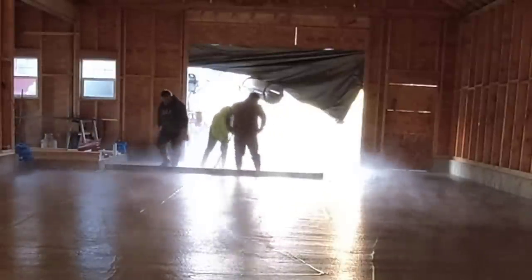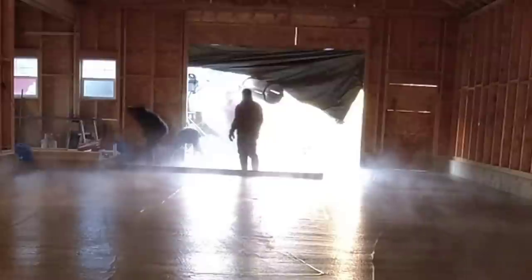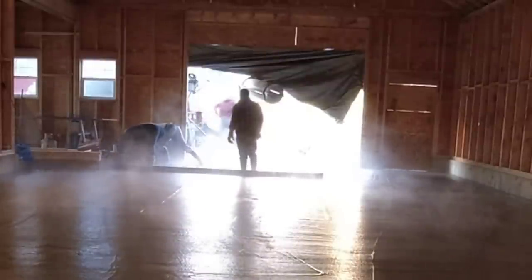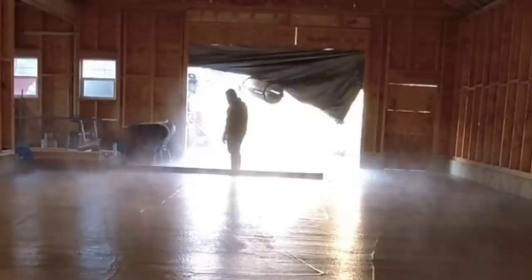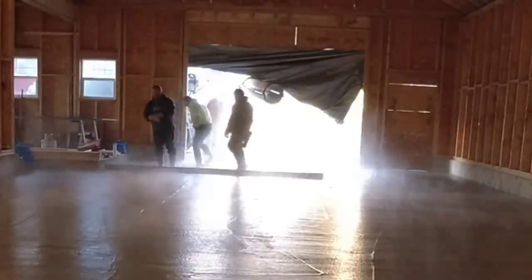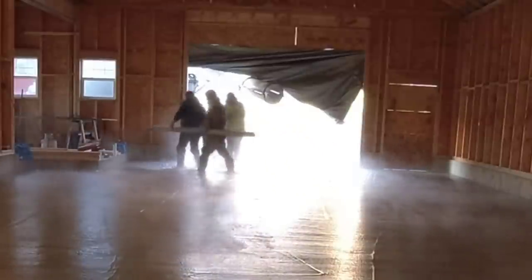That's a 14-foot screed right there. We got all sizes of those. Those are 2x4 magnesium screeds. We got them from 14, which is the longest one we have, down to about 4, in 2 foot increments. A couple of them are 1 foot increments, but we got, I don't know, 6 or 8 screeds that we use on different applications.